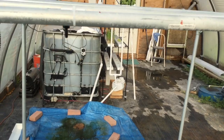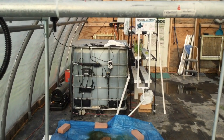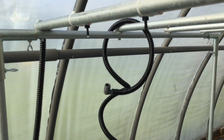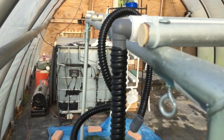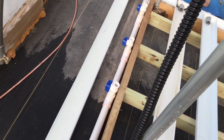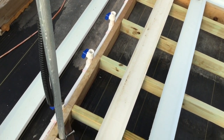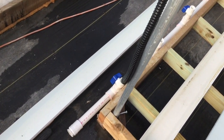This makes plumbing a whole lot easier. If you don't have to buy a whole bunch of separate fittings and cobble things together, you just drill a hole and thread it so you can twist the fitting in there. These little manifolds — distributors, whatever you want to call them — are connected by just plain old pond tubing going down to a one-and-a-quarter-inch schedule 40 line down there. There is a separate valve for each row of towers. I put the valves down there on the bottom because I don't want the actual pressure inside of this — I would rather have all of my pressure down there at the bottom.